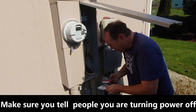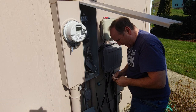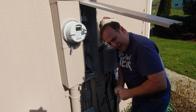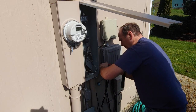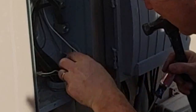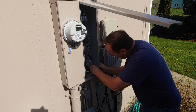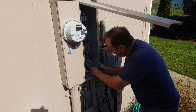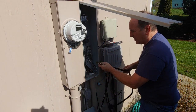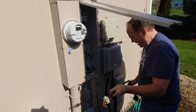I'm going to run this out of one of these holes down here and pull this out. This is a three quarter by half, so I'm going to do the knockout over here. There we go — open it up, put this baby on right here, easy to put in, easy to take out. Then I'm going to go in and cut it off.